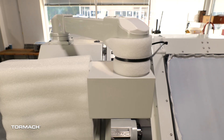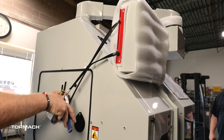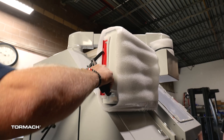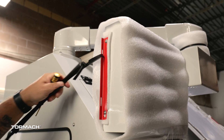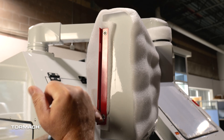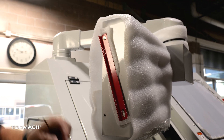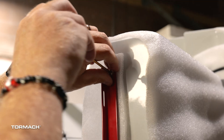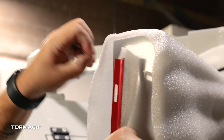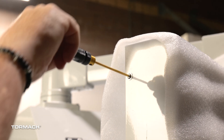Several items are strapped in place to prevent shipping damage. Start by cutting the straps for the operator console arm using some snips. Using a hex wrench, remove the first button head screw and move the bracket aside. Re-secure the screw into the original threaded hole. Do the same with a second screw and set aside the shipping bracket. Do not discard.